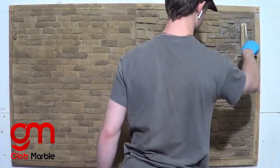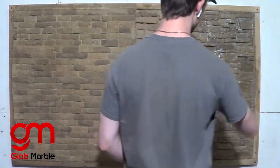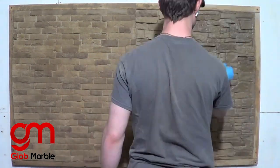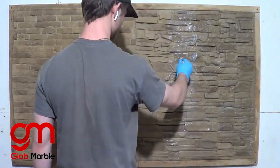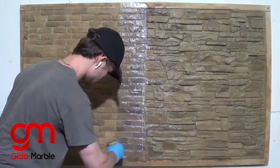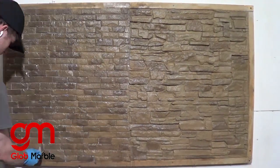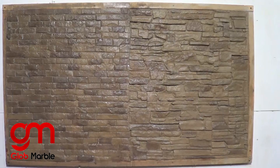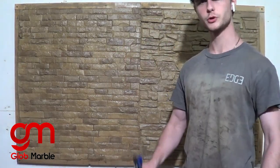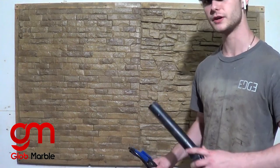You don't want it to drip. Once the stain completely dries, it's time to apply the sealer. For hard-to-reach areas you're going to want to use a brush as well. Once your sealer is completely dry to the touch, you can apply your second layer. You can also use a pump sprayer to put your sealer on, which usually works out a lot faster, so it's more convenient for large areas.